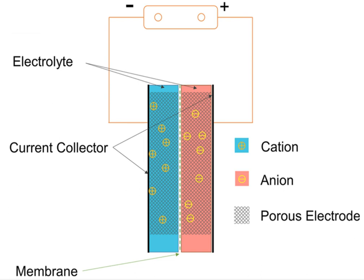Recent developments include lithium-ion capacitors. These hybrid capacitors were pioneered by FDK in 2007. They combine an electrostatic carbon electrode with a pre-doped lithium-ion electrochemical electrode. This combination increases the capacitance value. Additionally, the pre-doping process lowers the anode potential and results in a high cell output voltage, further increasing specific energy. Research departments active in many companies and universities are working to improve characteristics such as specific energy, specific power, and cycle stability and to reduce production costs.